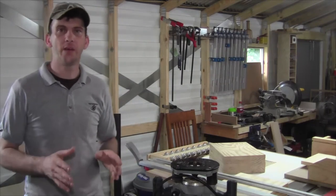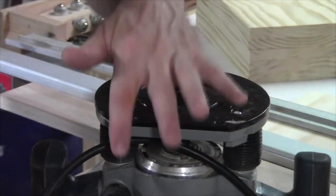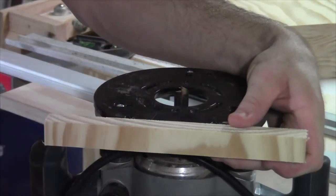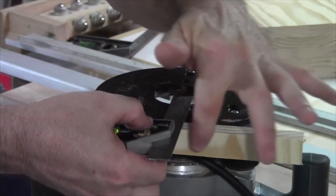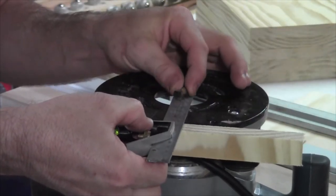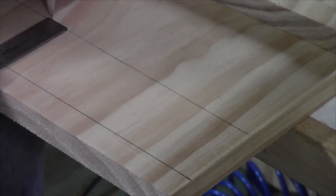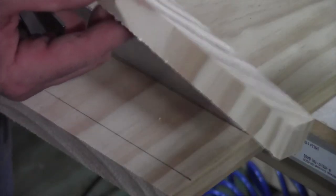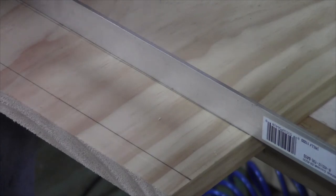There's a simpler way of doing this. Since I have scrap pieces from the stock I'm using and a nice flat edge on my router, I can take that piece and lay it up against the flat edge of the router base, then use a marking square to set the depth from the outside edge of my work piece. Once I have that setting, I bring the marking square to my work piece and lay out my line — and that line is where my guide is going to go. Using the scrap cut-off against the router ensures the router bit will cut right along my three-quarter inch layout line.